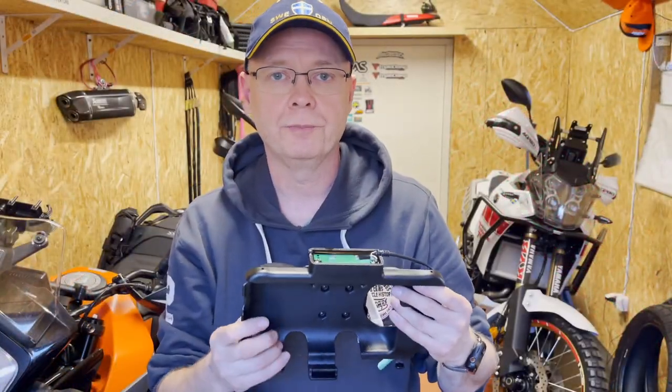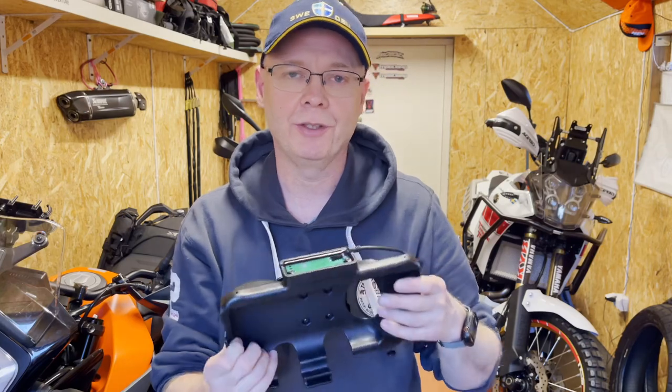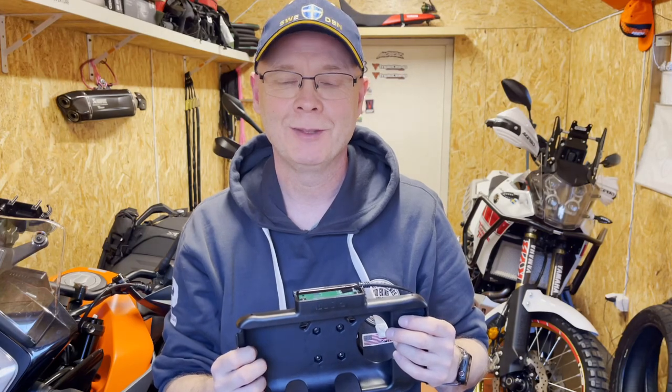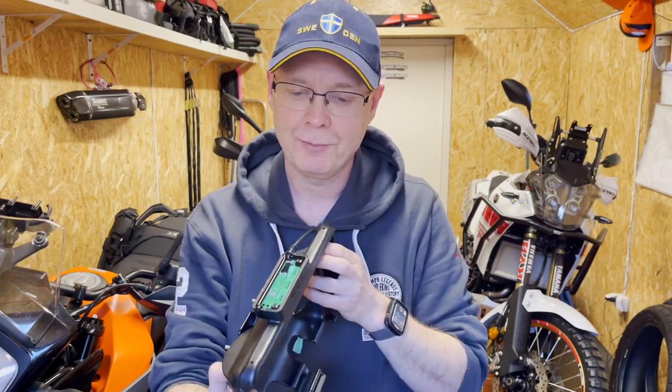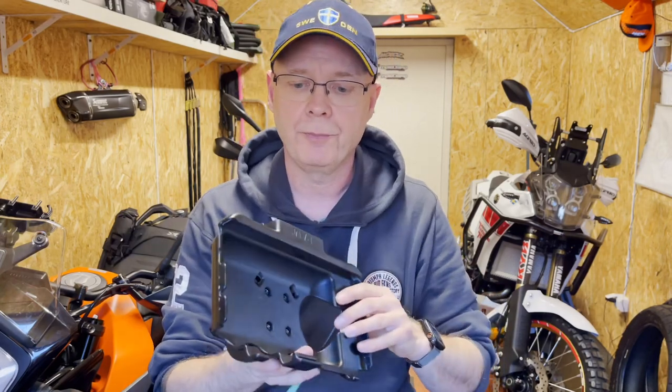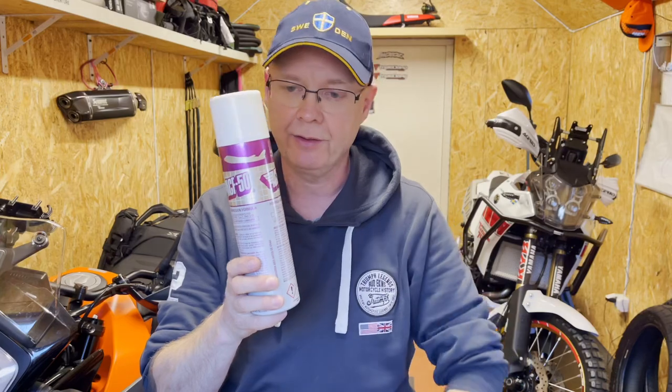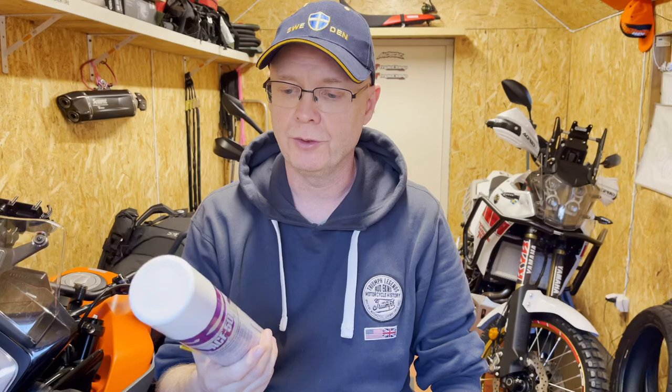So what do you think? Will it work? I'm not sure yet, but at least we will give it a try. Now we have to wait for the first spring rain. It might work. As I said before, those pogo pins of brass in the bottom of the holder — I might just dab them a little bit with ACF 50 on a Q-tip. It will stop any corrosion for sure, but it won't necessarily stop water going down and causing a short circuit. We will see. Thank you for watching.